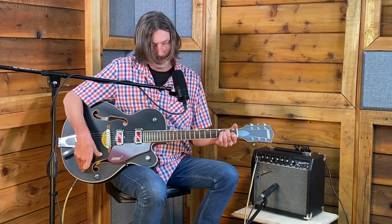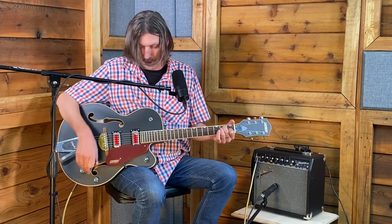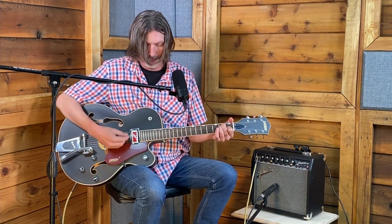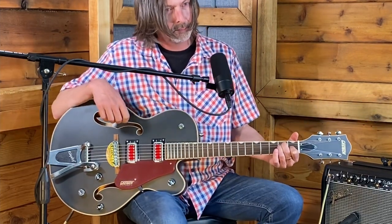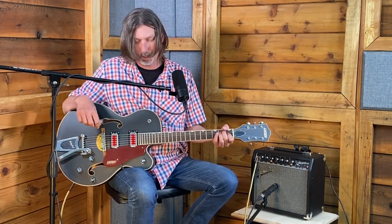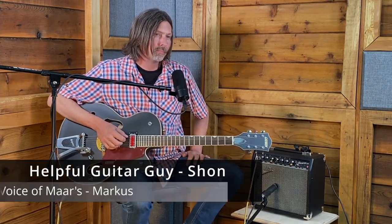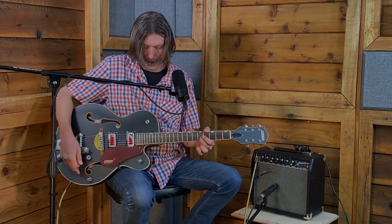Down at the bottom is a master tone control for both pickups. The reason for this layout is that in the middle position you can adjust how much of each pickup you get — like on a Les Paul — but you can then adjust the overall master volume without messing up the blend. It's a bit more complicated, and wiring it inside a hollow or semi-hollow body is an adventure. Thanks to Sean for breaking down the common configurations of electric guitar controls.